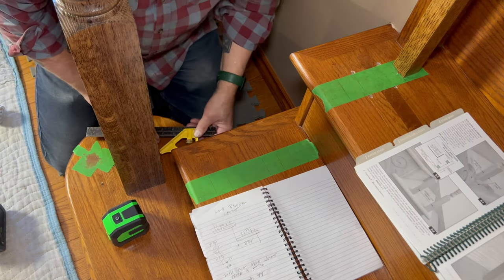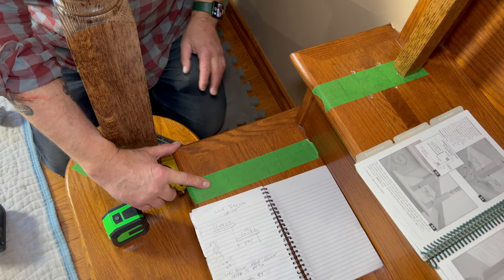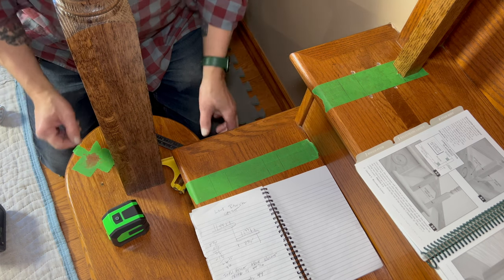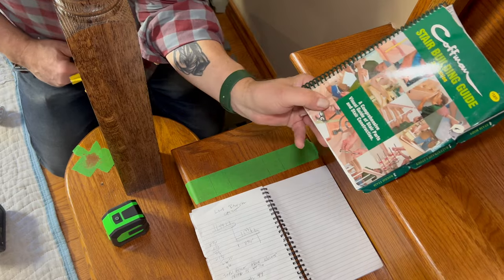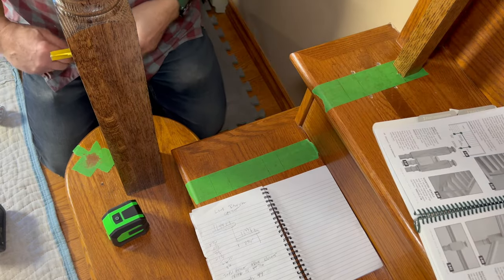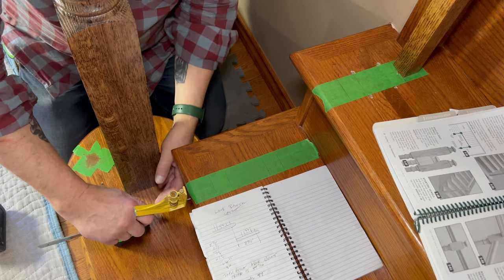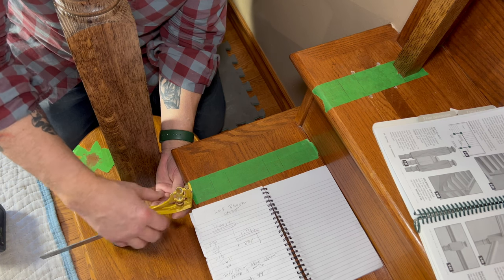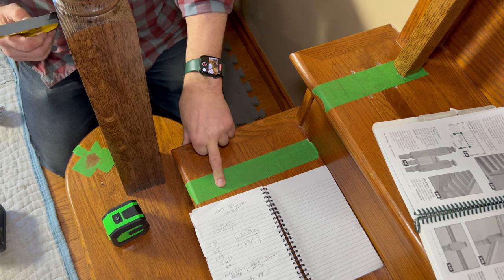So I will just explain to you how you lay out balusters on this type of open staircase. If you look at a book like this Kaufman Stair Building Guide, the general rule is that you always have the baluster in line with the front of the riser. In this case, we've got a 1¾ inch overhang on the riser, so that's where the first baluster is going